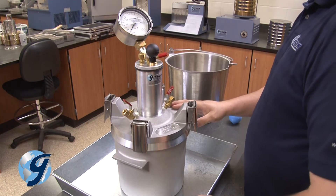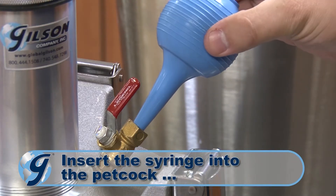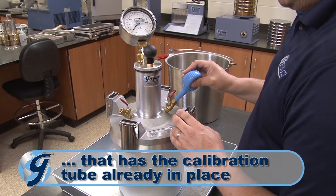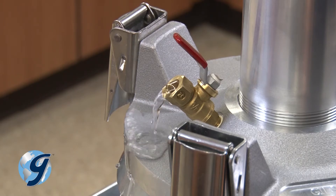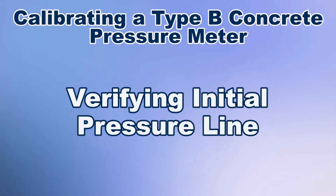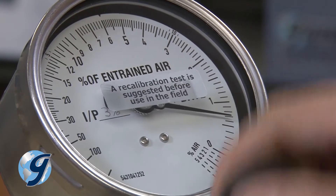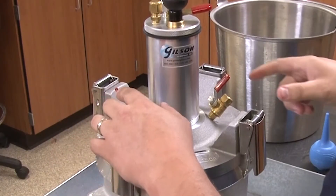To complete the filling of the meter with water and expel all remaining air, fill the blue syringe with water from the water bucket and place the end of the syringe inside the petcock with the straight calibration tube attached to it. The base is full when water flows out the opposite petcock. Once you assure the air has been removed and the base is full of water, pump the unit up until the dial comes around to the predetermined initial pressure reading, visible at approximately the 5 o'clock position, and then close both petcocks.